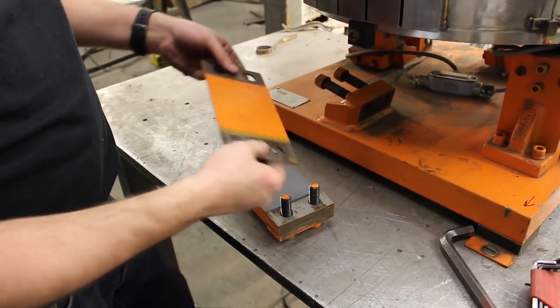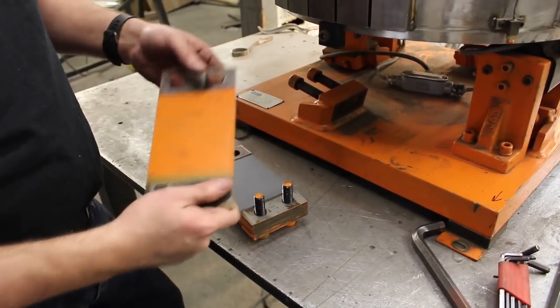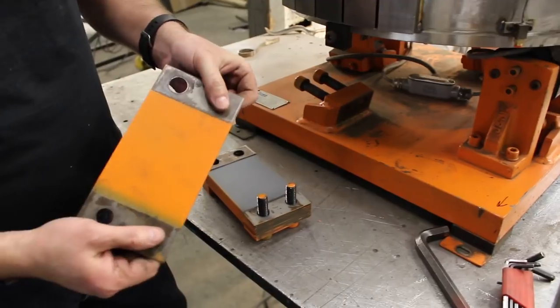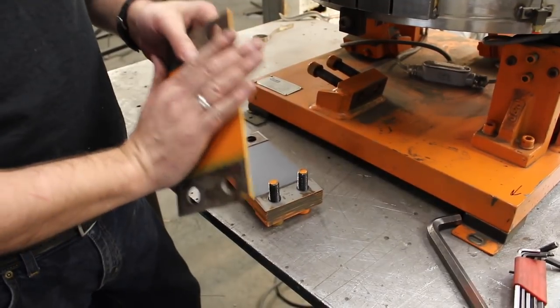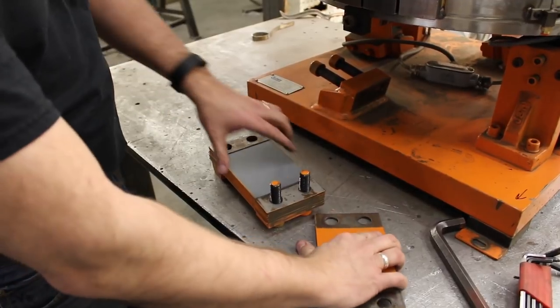It'll just finish the job. These are good springs, and believe it or not you don't ever want to replace the springs on a unit if they're good like this, because work-hardened springs that have been in the field for a while are the best in the world — they're not going to work harden anymore. Once they've been in the field for a few years they're as good as they're going to be. They're tempered. They're either going to break or they're going to work, and that's the great thing about it.